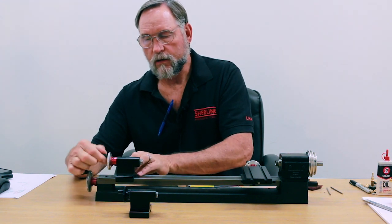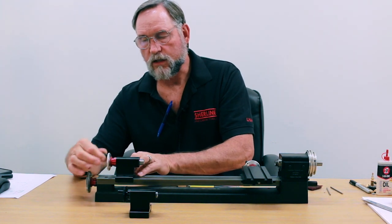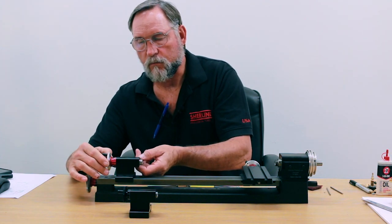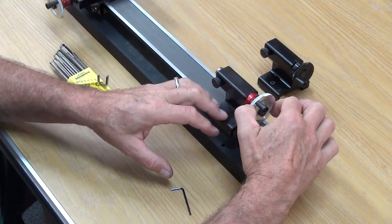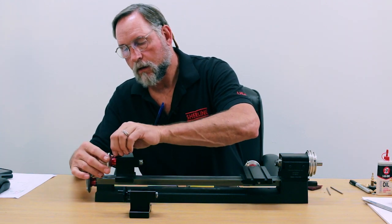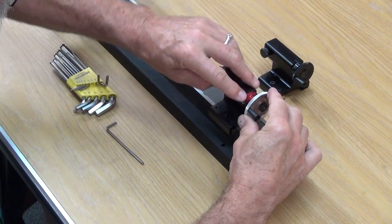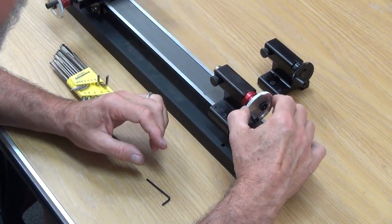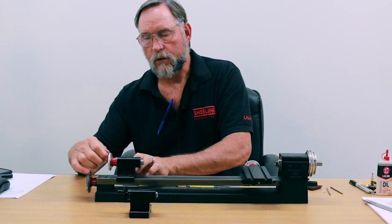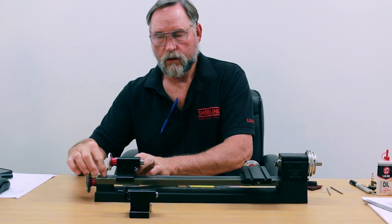If I loosen this — that's moving pretty good but it's got a slight tight spot, so I would actually loosen it up just a hair. Where they had it at about one and a half is about where it belongs. So I'm going to tighten it down again, turn it to the right to load the screw, loosen it, hold it gently against it, tighten it down on a fresh area, and now I've got two thousandths.